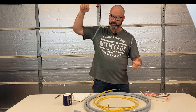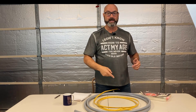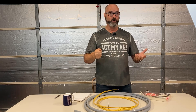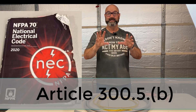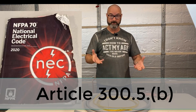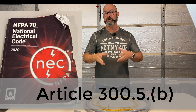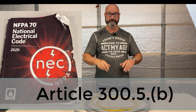Here's the other place: you're doing a kitchen remodel, pulling power underground to a kitchen island. When you pull wire through that pipe it should either be THHN or THW individual wires, or UF cable — not Romex. Here's why: Article 300.5(b) says that any underground conduit is considered a wet or damp location. So as soon as we pull that 12-2 or 12-3 underground to that island, even though it's inside the kitchen inside the house, once it's underground it's a wet location. Red tag. Can't do it.